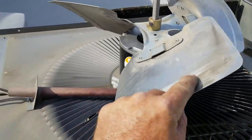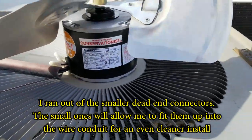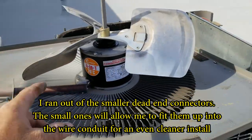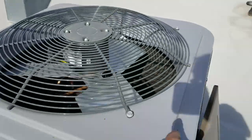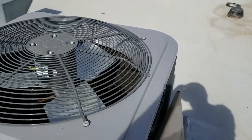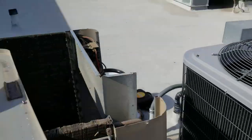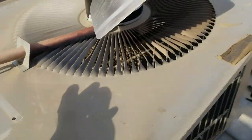This is what it'll look like — the wires are not long enough to possibly drop down into the fan blade. It's over an inch clearance. The blade's close; definitely need to get real close on a cheap generic unit like this. It doesn't even have a shroud. See how this one has a built-in shroud? By design they usually have the blade kind of up in there — probably the same thing with the Trane unit, but not with this unit.